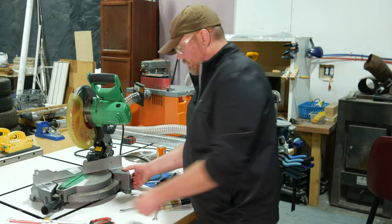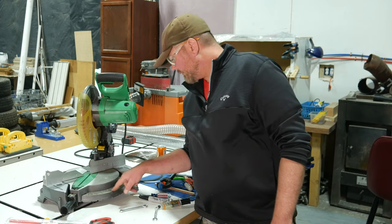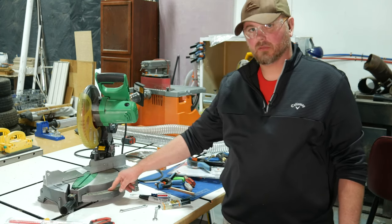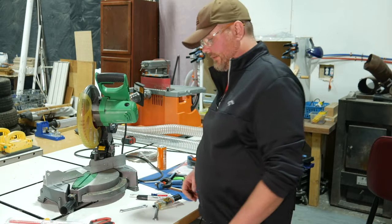One of the little things I'd like to fix is the miter gauge here — it's kind of loose. There was a little rivet that looks like it broke off. Rather than trying to drill a hole and thread it or put another rivet in, I'm just going to mix up a little bit of five-minute epoxy, stick it on there, clamp it, let it dry, and that should work just fine. I'll use a little denatured alcohol to clean the surface off first.